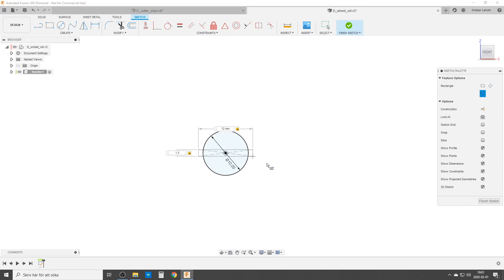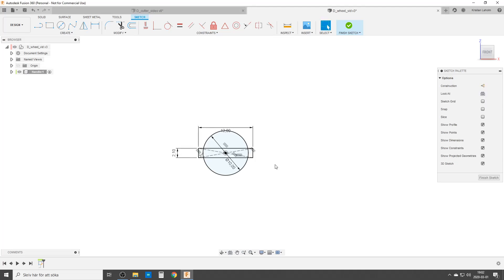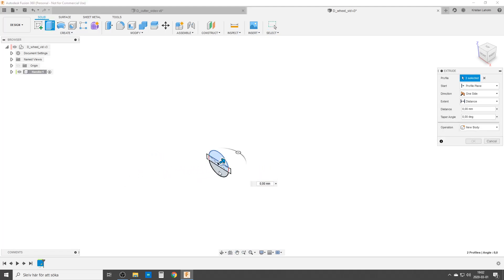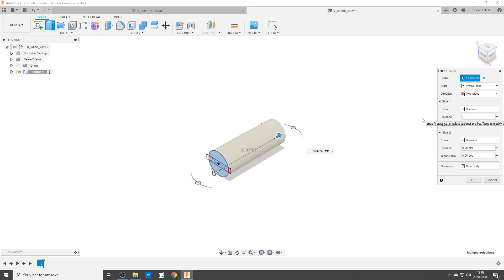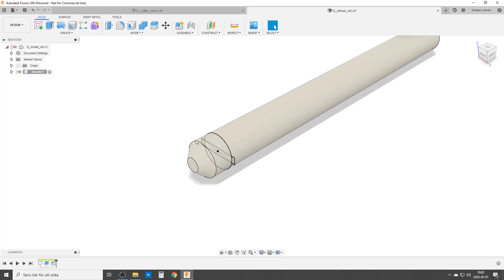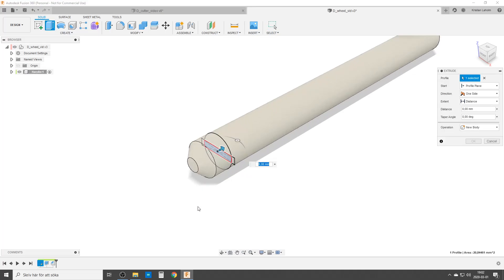I'm gonna use 1.5 millimeters for the surface — the wavy part — and then thicken that with 0.2, and make it symmetric on both sides. I'm gonna make a small gap, so 0.2, something like that. Now we're gonna extrude, starting with this side, it's gonna be 100 and 8. Feel free to play around with your own dimensions. We're gonna create a chamfer on these two sides — it's gonna be 3. This looks strange so we'll switch over to that mode. We're gonna extrude this cutout now.